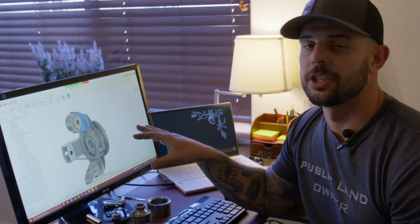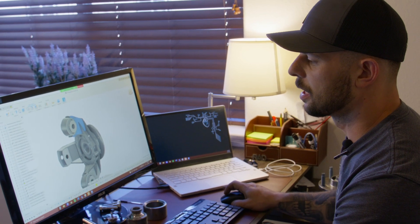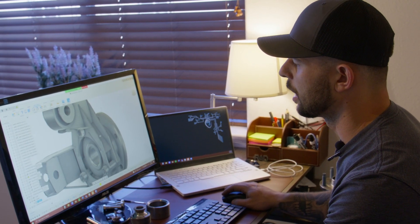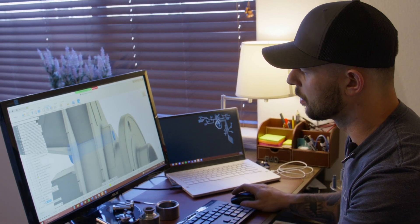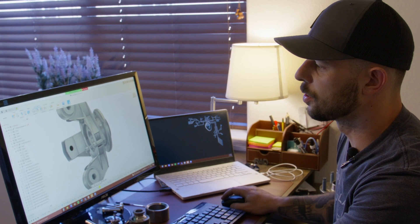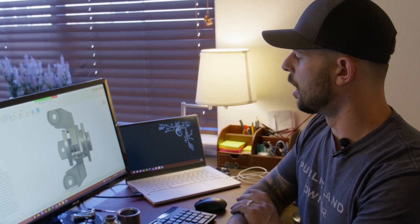I'm going to create a bunch of DXFs, take them over to the CO2 laser, cut these all out in cardboard, and check the fit to make sure everything looks good clearance-wise. One great thing about the program I'm using is that I can bring in McMaster parts — nuts and bolts I'm actually planning on using. I pulled in the bolt I'm planning on using, and we can see it registers all the way through the part, nice and flush with the back of the C7 hub. I have about a quarter-inch clearance at the back of the stub axle — everything looks really great. Let's create those DXFs, go to the laser, cut them out, double-check the design, and get them to SendCutSend.